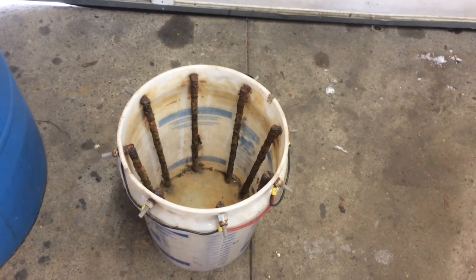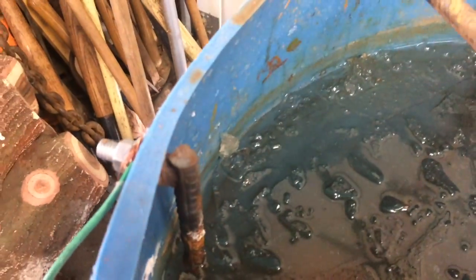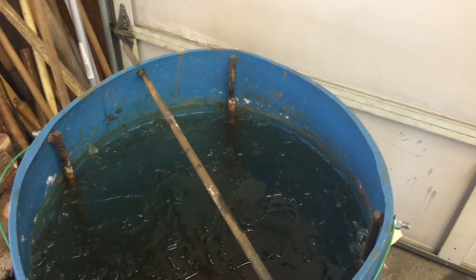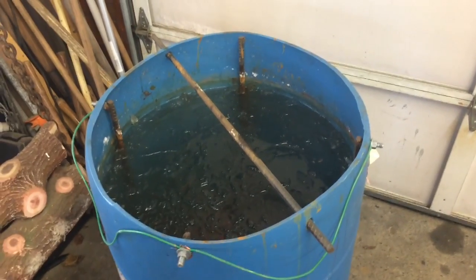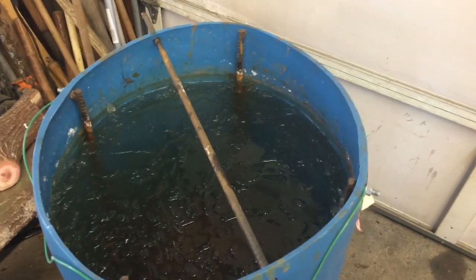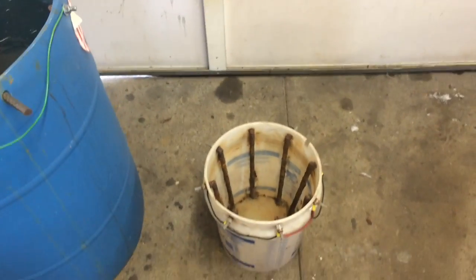This is my 55-gallon drum — there's ice in there now since it's winter — but the same setup: rebar with a bolt and nut welded on, going to the bottom of the tank, and you hang your part from a bar across the top. What I use is Arm & Hammer washing soda — about one tablespoon per gallon of water. Mix it together and that gives you a liquid that lets electricity flow through for the electrolysis process. It's daisy-chained all around as well. Hook it up to a battery charger and there you go — it's amazing how much rust you can get off.